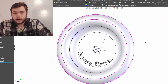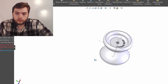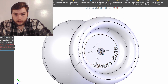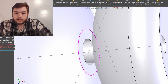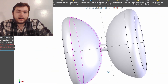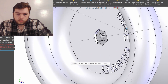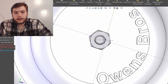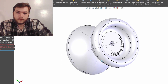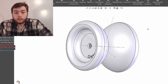I put together an assembly design to show a general idea of what it should look like. The front side has the screw head going in, which goes through and connects into the other part of the yoyo. I gave it a bit of tolerance — wiggle room — so it fits without being too tight and needing a reprint. The screw goes all the way through, the nut fits into that hexagon hole, and we have the channel name on both sides. We're going to print this and see how it turns out.